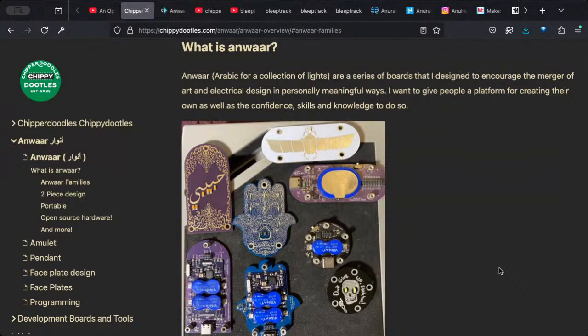All right, so I'm looking at this and I'm finding we've got the capacitor, we've got the connector, we've got those standoffs. How are those attached? They're tapped so that I can screw the bits in. Are they soldered on? What's the deal? It looks like they go at least partway through the PCB. I'm not too familiar with this type of standoff. My guess is that they may taper and go into a hole, which is then connected to, they're all grounded.